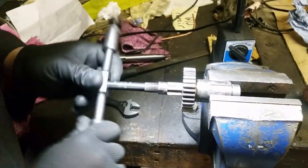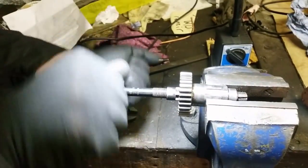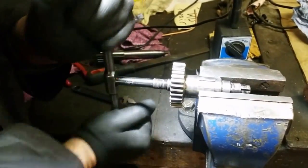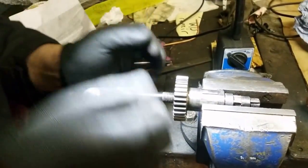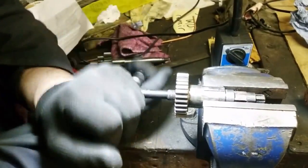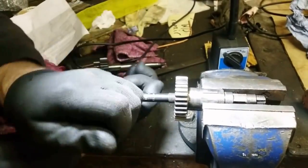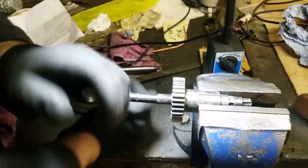So when you've got it the correct size, what sort of feeling should you have? A nice sliding fit - not tight, just a nice sliding fit so that with a bit of oil it'll spin quite nicely on the shaft. And you shouldn't feel any rock in the shaft, preferably not. Wonderful, well thanks so much Mick, here at Dragonfly.